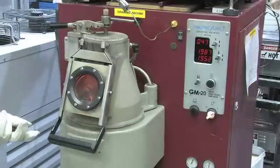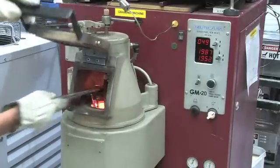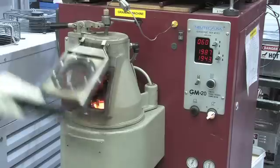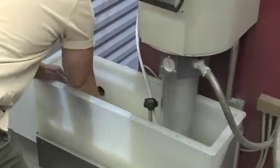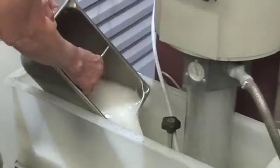Add the next batch of metal to the crucible to melt. If you're in continuous mode, the auto valve disc will automatically allow metal to drip through its perforations into the water. Continue to feed your sprues and scrap into the crucible as the crucible empties. When you're finished making grain, lift the sealing rod allowing the crucible to empty completely into the water and then turn off the machine.